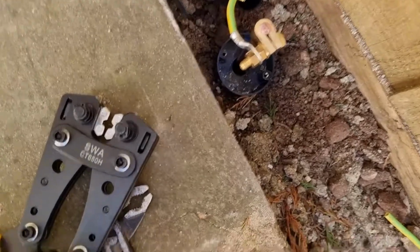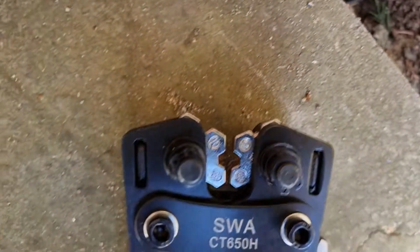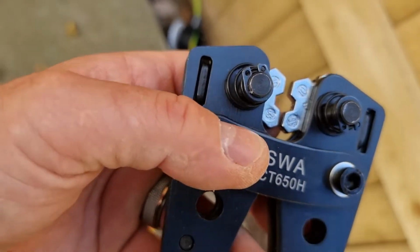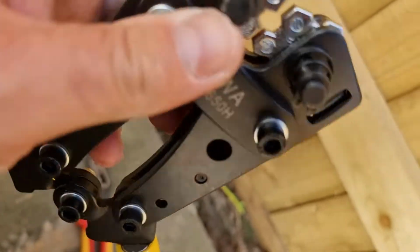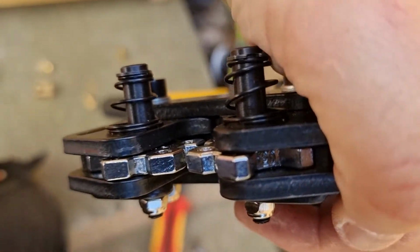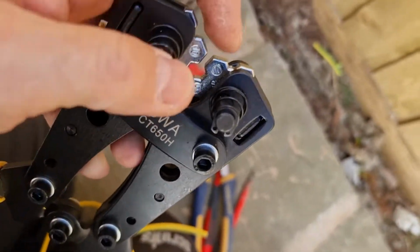I'd show you this quickly. This is what we would call a crimp, and this is a crimper. So this one effectively, as you can see, has what we call a die in there, and they're all different sizes. So it tells you on there that's 10 mil, the next one round's 35, and you've got 6, and let me show you, let's turn it around that way. That's 20, that's a 6, see? So you just spin that where you want it to be.